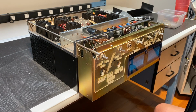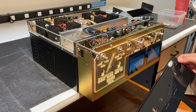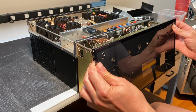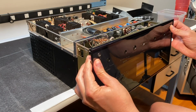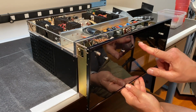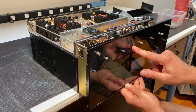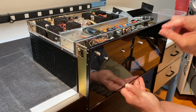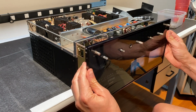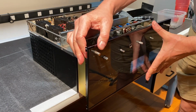Okay, I'm going to slide the glass assembly into position now. Note your Panlock push buttons. Those are the first two things you want to align on your glass dial. Okay, so align this right one on the left. Now also be very mindful that the potentiometers line up correctly, and also this headphone jack. If the headphone jack isn't centered directly within this grommet, remove this and then reorient the jack. It needs to be right in the center. Okay, and if everything looks good, you can slowly proceed to pressing it all the way in position.